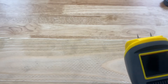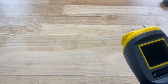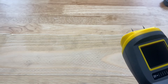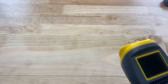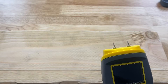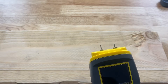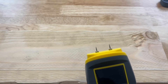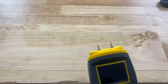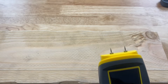What's considered a good reading for wood on a moisture meter? You can break it down into low, moderate, and high or saturated. The low end would be around 5 to 12%, the moderate would be around 12 to about 17%, and above 17% is considered higher or saturated, which is not that good. For a building or structure made of wood, the acceptable reading for the interior should be around 6 to 8%, and the exterior should be around 9 to 14% as an acceptable range.